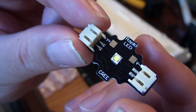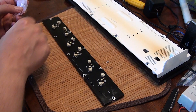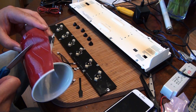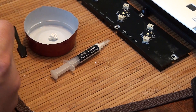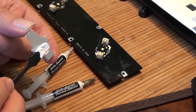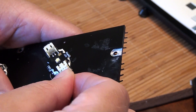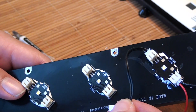The LEDs have a particular orientation and it's really easy to tell what that orientation is. Here I'm testing out the spacing, and here's the thermal adhesive. It works just like any other epoxy where you mix equal proportions or close to it. I put a very small amount on the back, then place the LED and squish it into place where you want it, and let it sit for about 30 minutes to an hour. It was very easy to work with. From there I decided to plug in the power and go ahead and daisy chain up the LEDs.